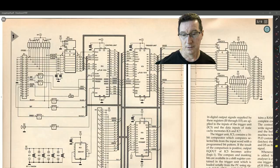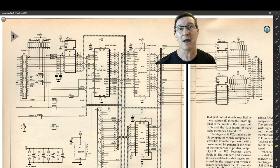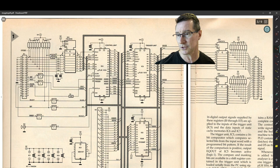As for why we both chose the 62256 SRAM — I used it because it was cheap, readily available, and used in PCs. It was standard 32K SRAM. Unfortunately, Elektor only used 4K on theirs, so mine was more powerful in terms of sample memory. Now, the PC parallel port interface is where it differs a bit. Laurent decided to latch data into internal registers in the control chip, whereas I didn't do that.